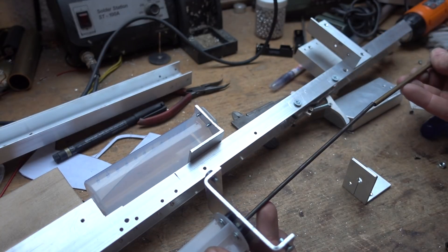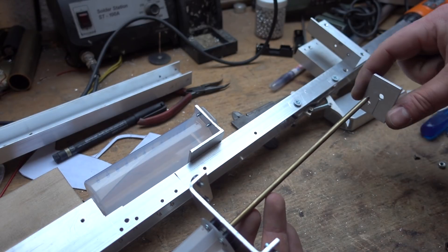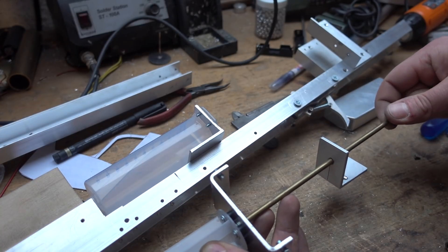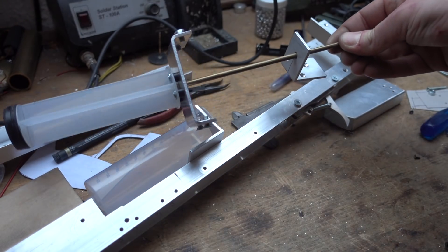In the middle there's a nut holding a little rod. It's an M4 threaded round bar with another nut to hold it in place — two nuts to make sure it stays on the plate. This is a brass tube, 4 millimeter inner diameter. This little thing will make sure it can't escape from the lock mechanism, which is up for explanation next. And that's the plunger.